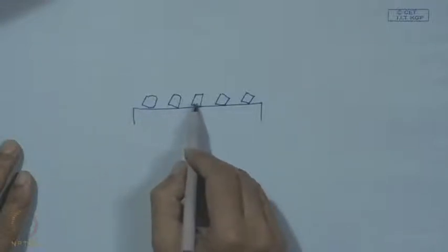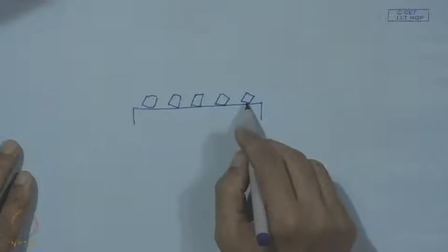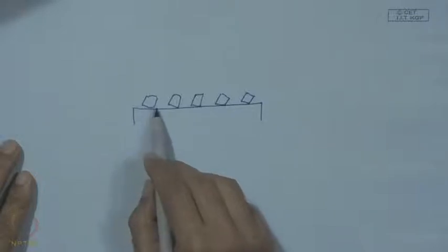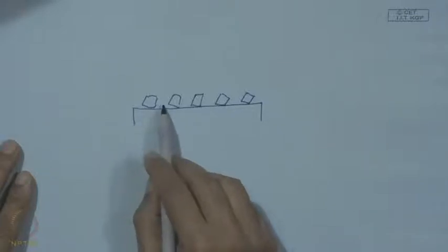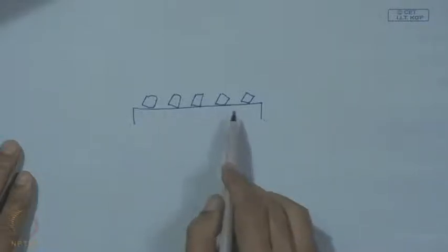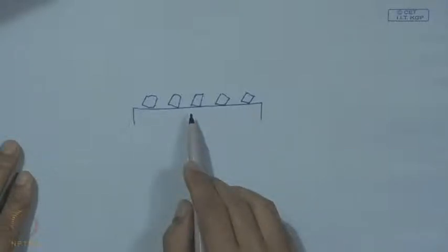The key question is how we are fixing these grains on the substrate — that is the bonding technique and the bonding material being used. At the same time, this is not a continuous layer of abrasive; there is some gap in between, which is intentionally done to achieve desired effects. This is exactly what we mean by a monolayer configuration, supported by one substrate.